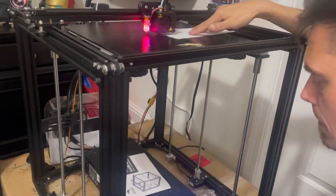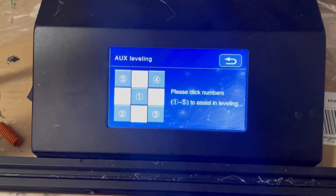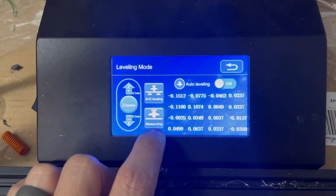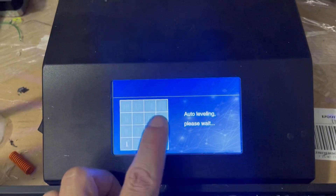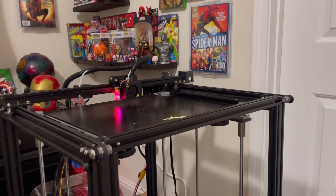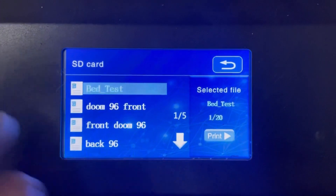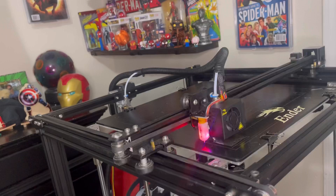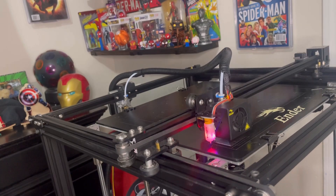Repeat that process at all five points on the printer. When you have each of those five points sufficiently leveled and a good amount of pull from the paper, go ahead and select the measuring option. The BL Touch is going to probe the bed at all 16 points, measure them, and make sure your bed is adequately leveled. If anything's off, you can go ahead and tighten and adjust as needed. Once that's all squared away, go ahead and do your bed leveling print test — load your filament, hit go.